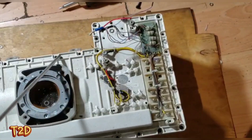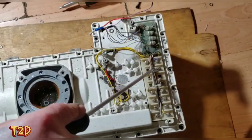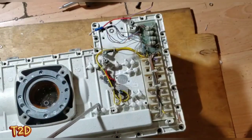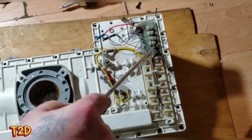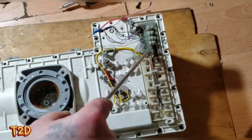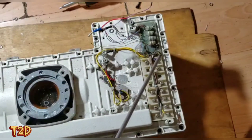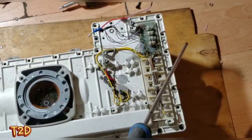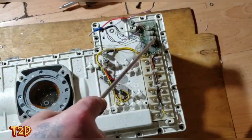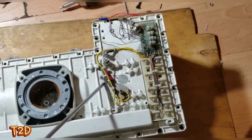After removing all the bolts, we can lift off the lid. On the input side there are two inputs for the high-frequency signal that drives the onboard high-voltage transformer, plus a couple of inputs for the filament transformer. These across here are gas discharge tubes - transient voltage suppressors that do the same job as an MOV or Zener diode. Inside the tank there's a very high-value resistor forming a voltage divider with an external resistor, and the gas tubes clamp any dangerously high voltages.